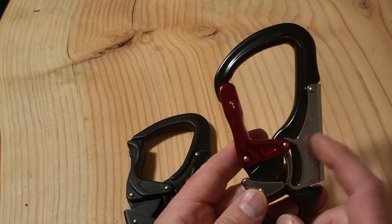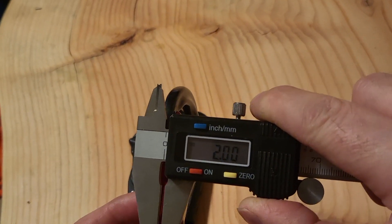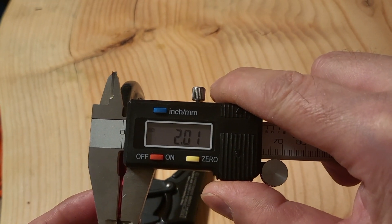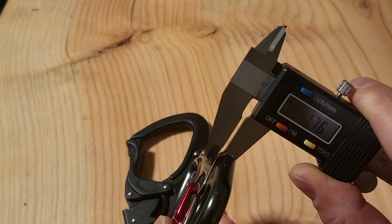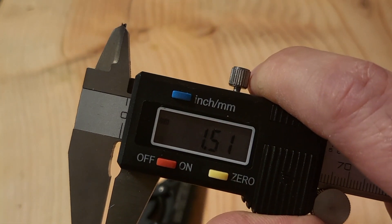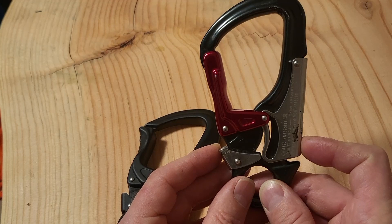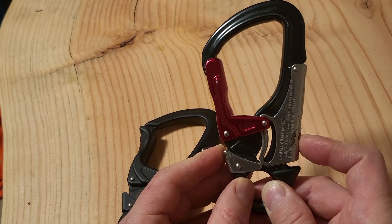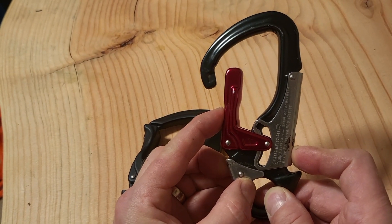So I'm going to show you what was happening. We're going to measure the third catch — the metal thickness is about 2.00 to 2.01 millimeters. And the second catch thickness is about 1.52 millimeters. So essentially what that means is this piece of metal is thinner than this piece of metal. So when the third catch starts to wear a little bit and the second catch starts to wear a little bit, it slides over top and locks in position, which is definitely not good.